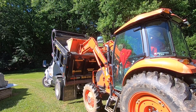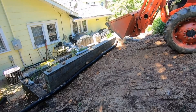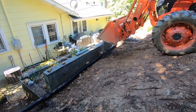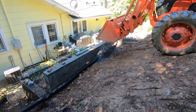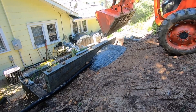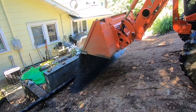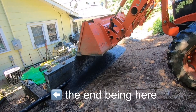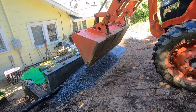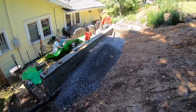Me and Emma are using the Kubota tractor with loader to take two buckets of pea gravel — each bucket weighing about 2,000 pounds — onto the top of this four-inch perforated pipe. The gravel will let water come through it and into the perforated pipe, which will carry the water out to the end of the retaining wall instead of saturating the ground behind the wall.